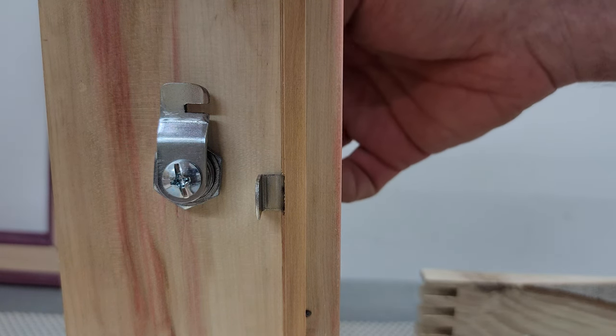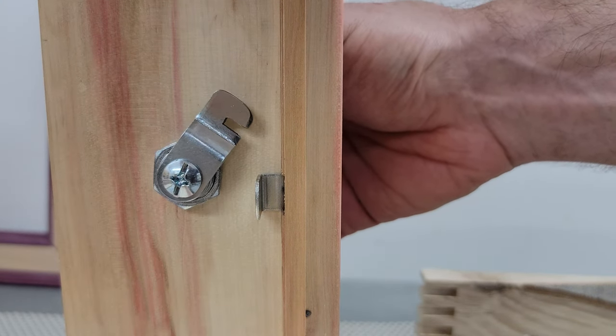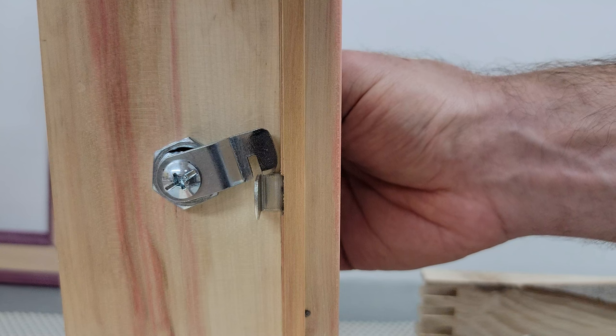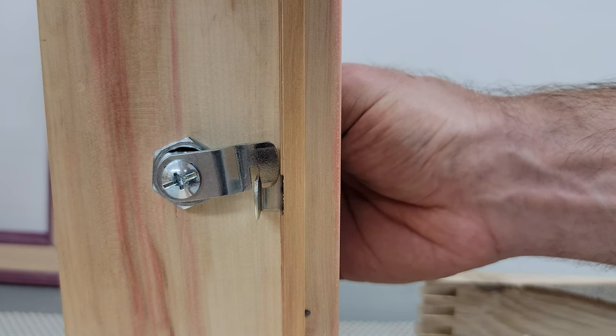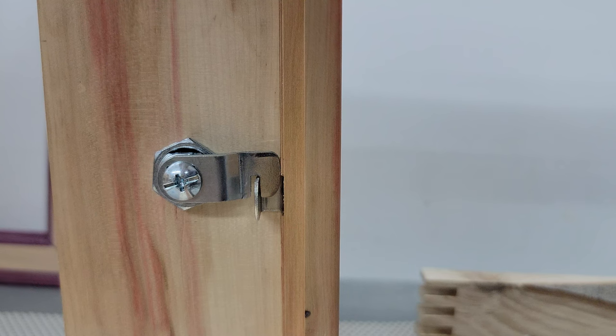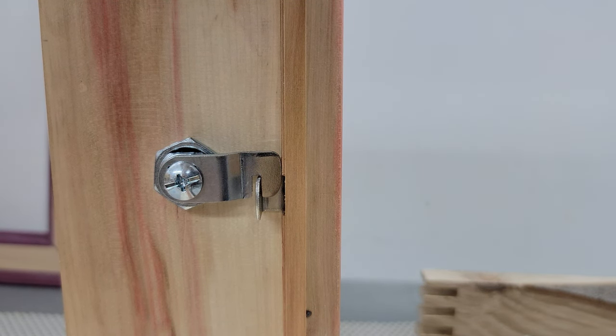Now let's close this up so you can see the spacing as it's coming down. Right about there, there's enough room on either side so it's not going to get stuck even if the door is not perfectly closed. We got positive contact in the front, and it doesn't take much pressure to get it to close all the way. When I take the key out, there's not going to be any movement on that door, yet it's not so tight that somebody would have trouble turning the key. I think that worked out just right. Hopefully this is everything you need to know to modify a mailbox lock to use on a wooden box. If I find a manufacturer who makes these with the hook already built in, I'll post it in the description or comments. Likewise, if you know of something, feel free to put it in the comments so the rest of us can benefit. Thanks for watching, and have a great day.